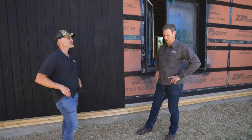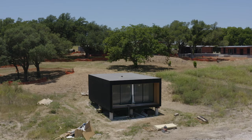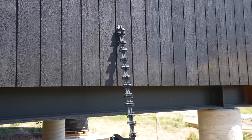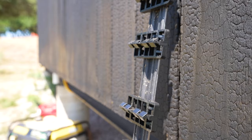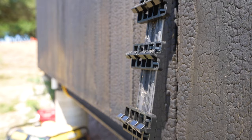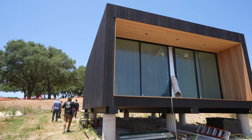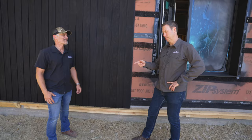There's also another type of Kebony going on with a different rain screen on a separate building - the exercise pod down the hill. There we didn't use exposed fasteners; we used Kebony's GRAD system, which is a click-in system. It's a track where the back of the Kebony has grooves routed in, and the board just snaps into place. I'm going to go meet Brian over there and get a quick tour.